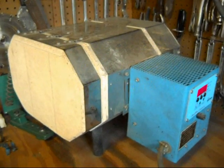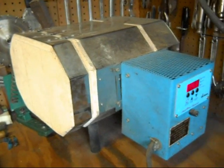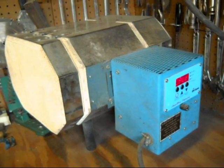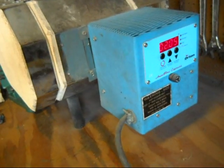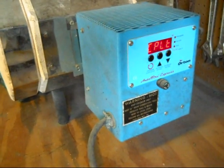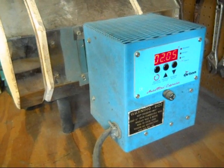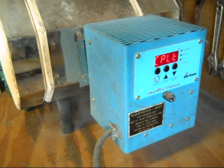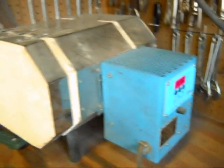I've done the tempering now. For tempering this type of steel, I temper it at 450 degrees for two hours, and I do that twice. This is the second cycle, and as you can see it's cooling down here. Temperature is down to 268. It's been off for a while — it's cooling down, it takes a little while.